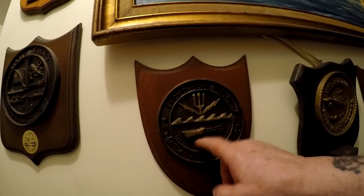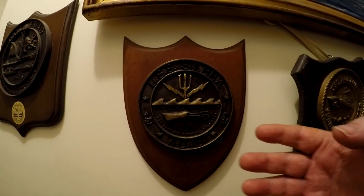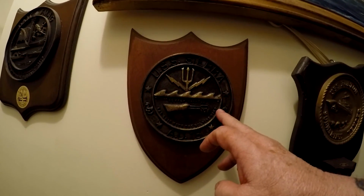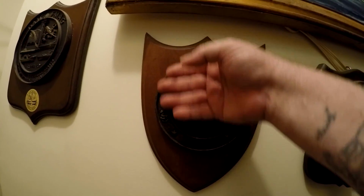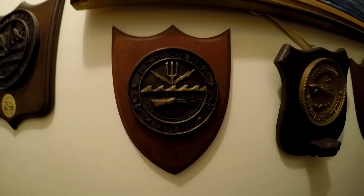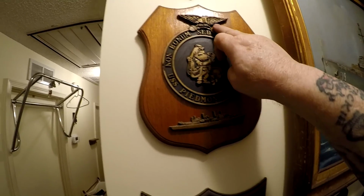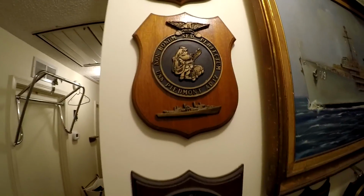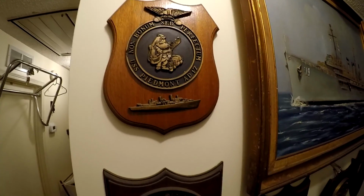While this is a plastic plaque, this is the type of effect, or rather what it would look like if you were making it out of bronze. We usually use bronze, and we acid treated it. Once the acid treating was dark black like this, we would take some light sandpaper and make all the highlights show. I don't have anything good here. Oh, this is better, this is off the Piedmont that I was on. All of this stuff would be highlighted with sandpaper, and then the finish would be a light coat of clear spray, like varnish or something.